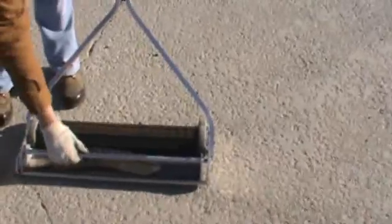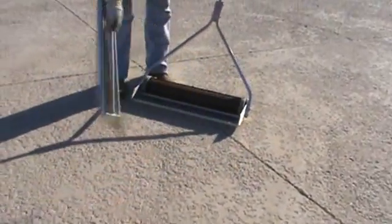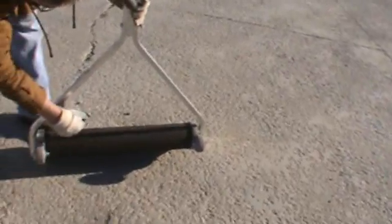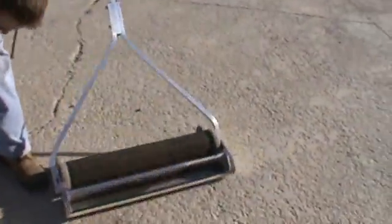The reason that the performance is so good on these continuous discharge sweepers is because the magnet at the bottom is continually cleaned off by the circular motion of the drum. Those drums are high impact PVC — it's an extruded drum. As that drum goes around, it's continually cleaning the bottom of the magnet off so that the magnet always is at its maximum power, which is really important when you're trying to pick up shot. On normal magnets, the magnet will just get filled up with shot and it just can't pick up anymore.